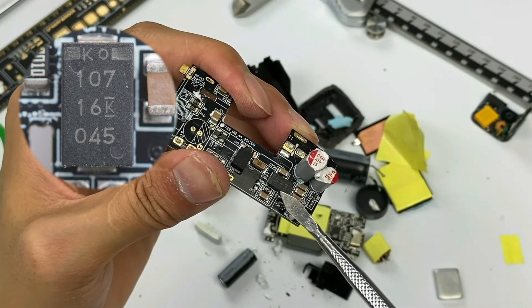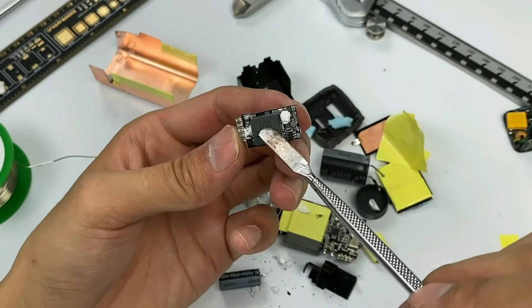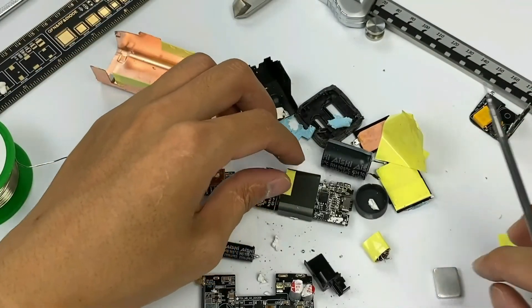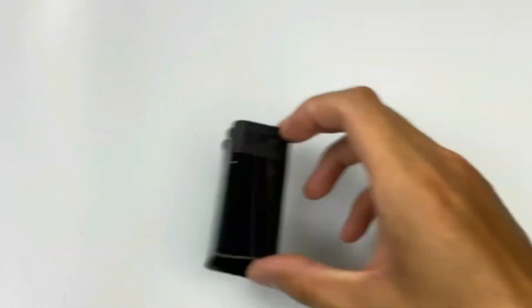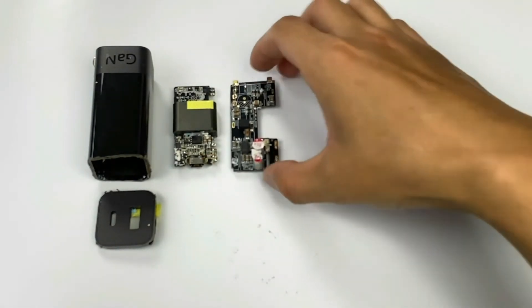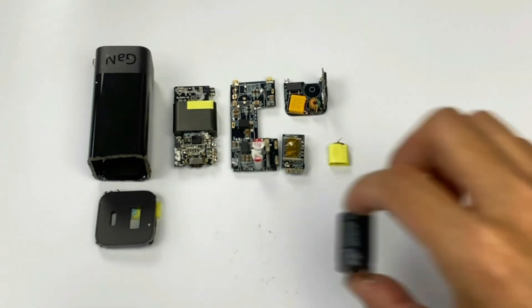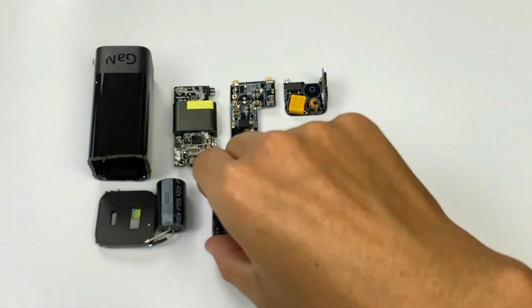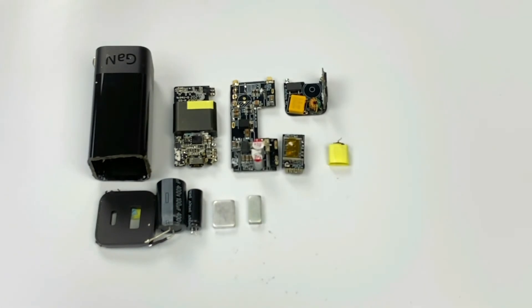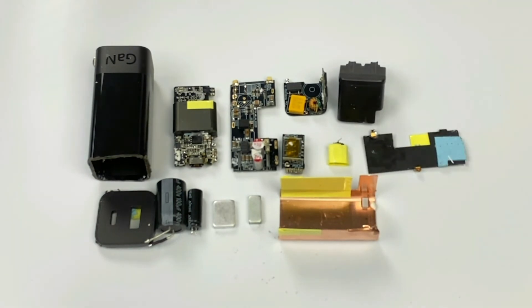Dust-proof stickers are attached to the USB-A port, and there is a buck-boost inductor on the back of the small board. That concludes today's teardown of the ZMI 65W dual-port GaN fast charger. Compared with the Xiaomi 65W dual-port GaN fast charger, the difference is only in appearance, especially color. Their performance and architecture are exactly the same — the PCB and main chips have not changed. So you can choose the color you'd like and buy whichever brand you prefer. Follow us on Twitter and subscribe to us on YouTube for more content.